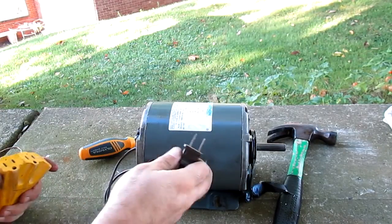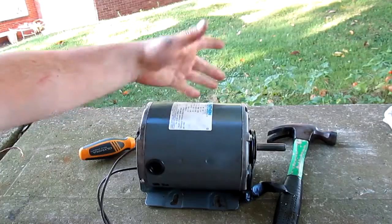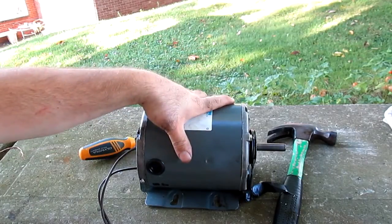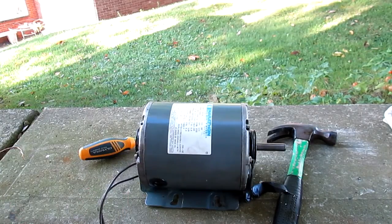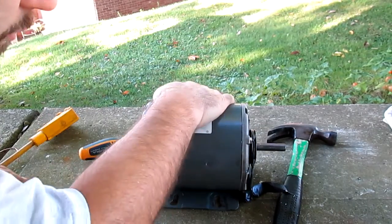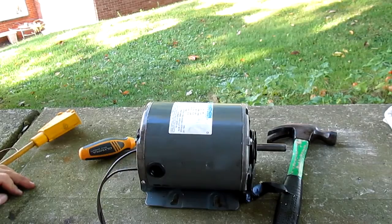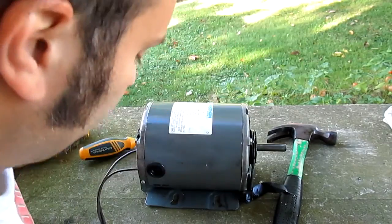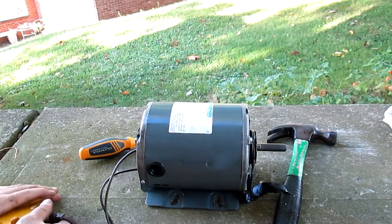You can kind of hear it now, but I only have two of the bolts in it. You can hear it runs. It's running okay, it's vibrating a little bit — but you might be thinking, what the heck's wrong with it? The switch kicks out. Switch engages. Think about that. What's wrong with this motor? It's running fine with a cord on it, but as soon as you put any torque on it — nothing, nada. It won't ramp up, it won't die. You don't hear that distinctive click of the switch going from start to run. It will not do it.